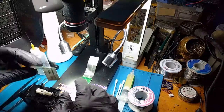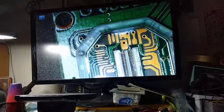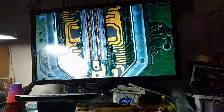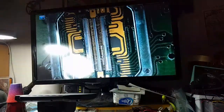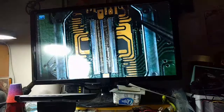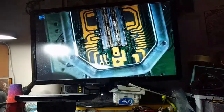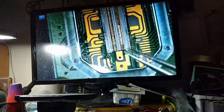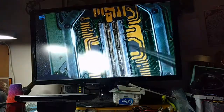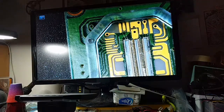Here are two fully OEM virtual ribbon PCBs. I'm going to show you on the new HDMI microscope monitor why it's so important to be careful of the LED array under the clear plastic. Those little tiny wires everywhere are making contact with the board, so you really don't want to get flux or anything near this clear assembly. I also don't recommend using a hot air reflow station or heat gun around these.